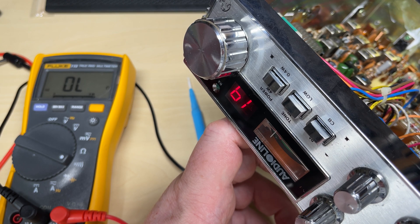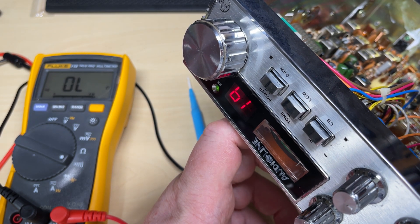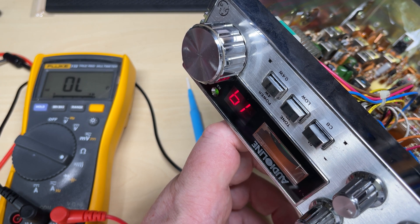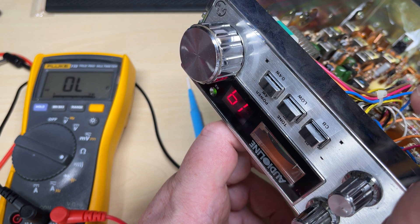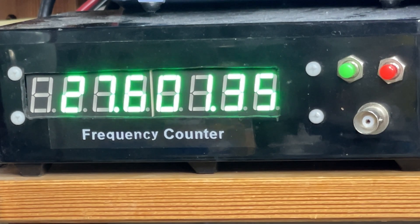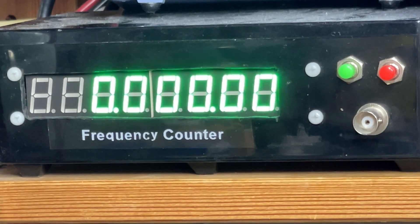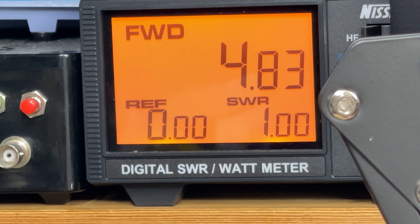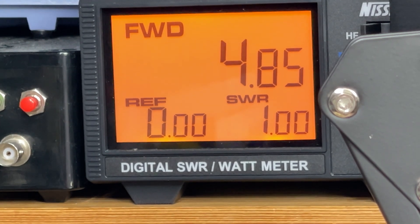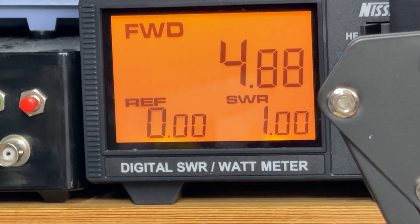So the curse of the 10-volt capacitors. We have a good transmit, high and low power is working, and it's receiving correctly. Check it on the frequency counter — it's as close as — yes, that's good enough. Check the power output: on the generous side, but that's fine — so nothing needs to be adjusted there.